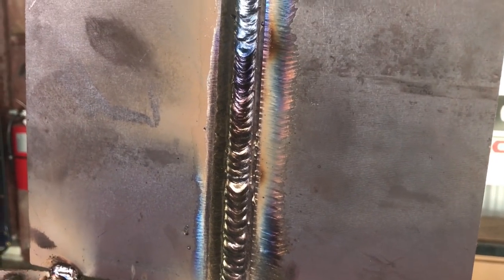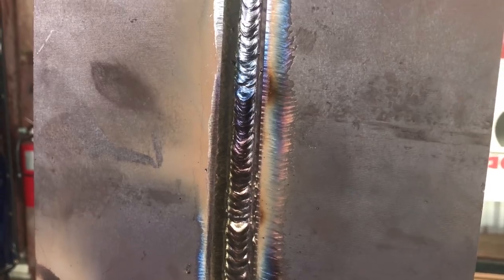Now onto the fills. Again, start on your backing strip and work your way up to your bevel. Me personally, I use a 3/32, but if you are on a time crunch, and it is a time test, if you want to fill it up quicker, then use 1/8. And 1/8 rods, I would preferably run them between 120 to 130 amps. But use the same motion, side to side.